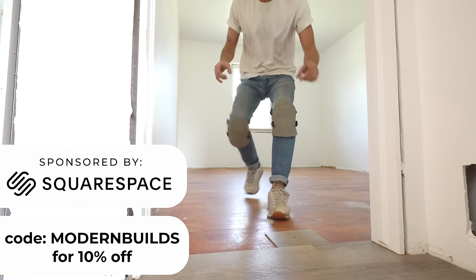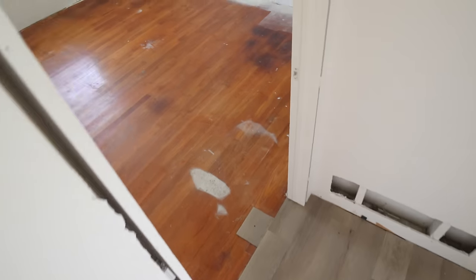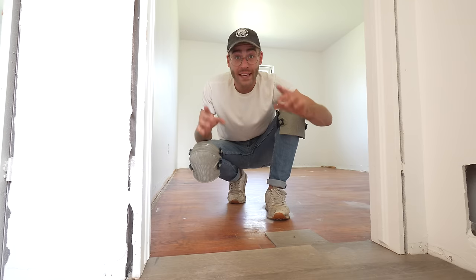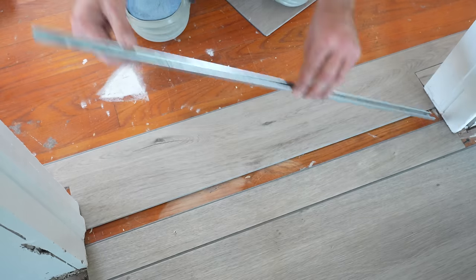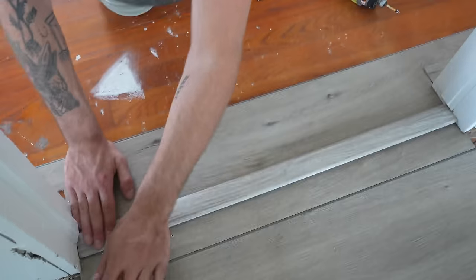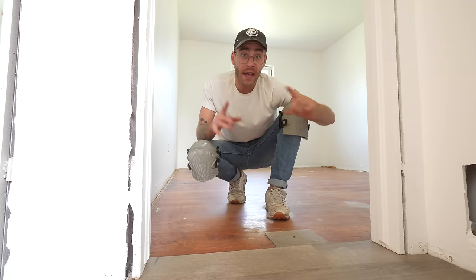If you're installing vinyl flooring in your house, it's inevitable that at some point you're going to have to work backwards. I'm doing a seamless vinyl flooring install, which means I've got to do this entire bedroom backwards. A simpler way of installing is just to use the threshold between two sections of flooring — say the hallway and a bedroom — so you can orient the boards and install them left to right the standard way, but I think seamless floors are a more premium look.